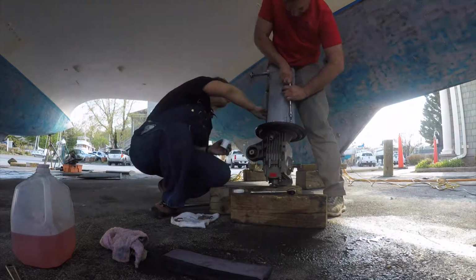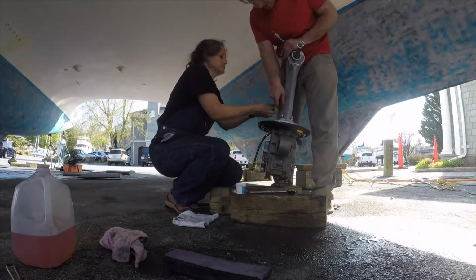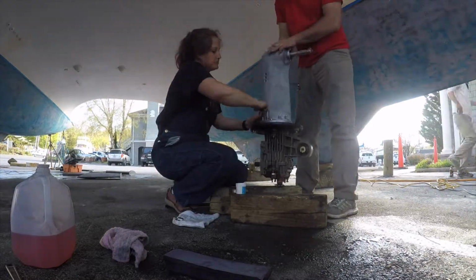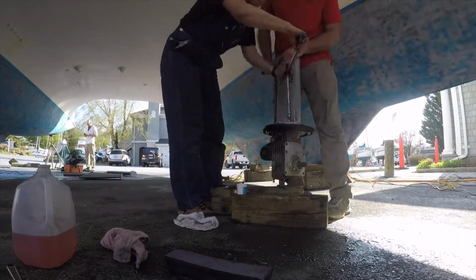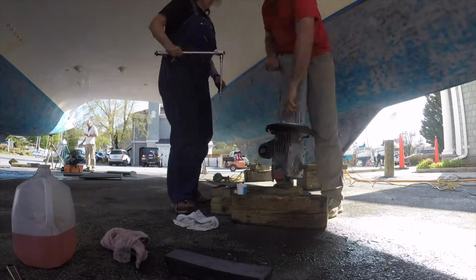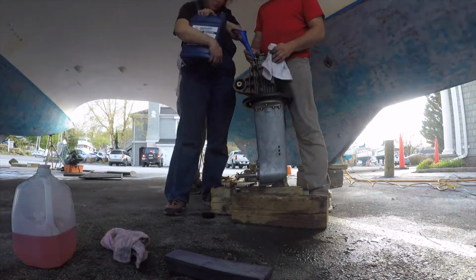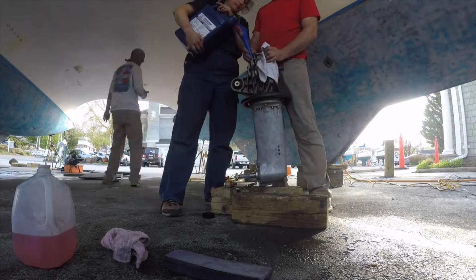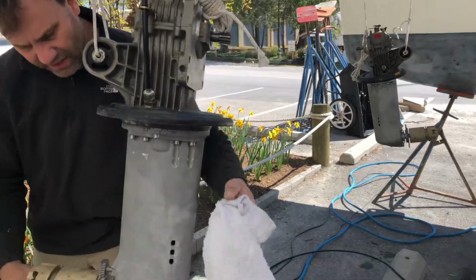We coat these bolts with Tef-Gel. It's good to fasten the bolts down evenly, so Chris would point out to me which ones to fasten, alternating on both sides. Volvo put out a service bulletin to use 15W-40 diesel oil instead of the transmission fluid that originally came in it.